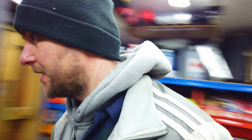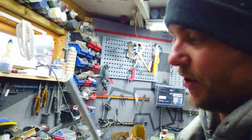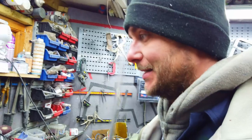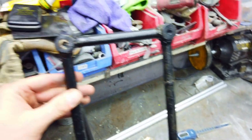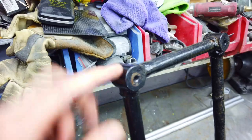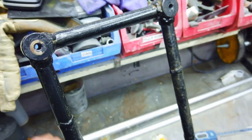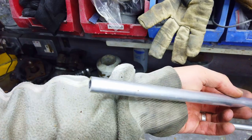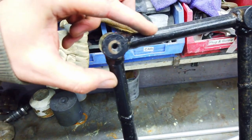Achievable, I think. What I have here is aluminum tubing — same diameter but aluminum, although I think the wall is quite thick. I think carbon fiber — yeah. After a bit of measuring I've decided we're definitely doing it out of carbon fiber. Should be easy enough. What we need is to make the end pieces out of aluminum. I'm actually pre-cutting it right now, so we'll face, fit and thread it, and we need a few lengths of this pipe which is 60mm.